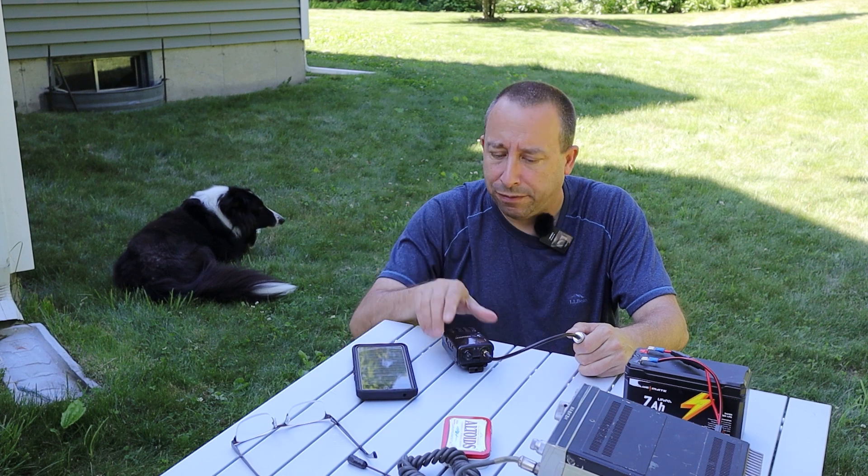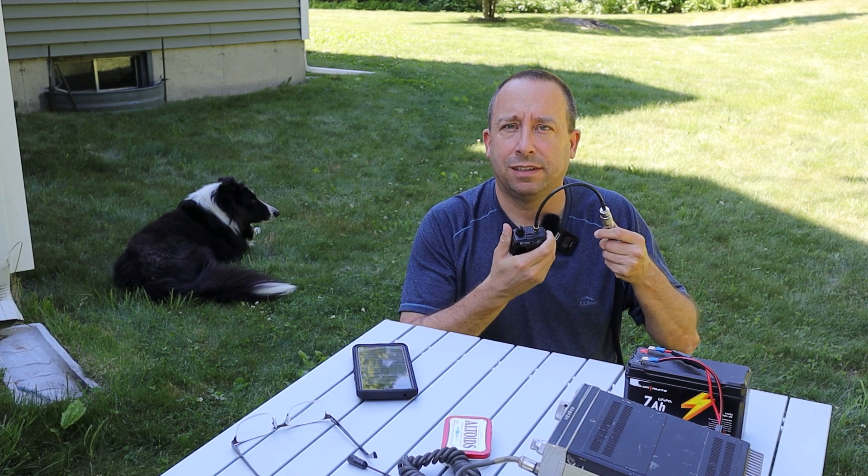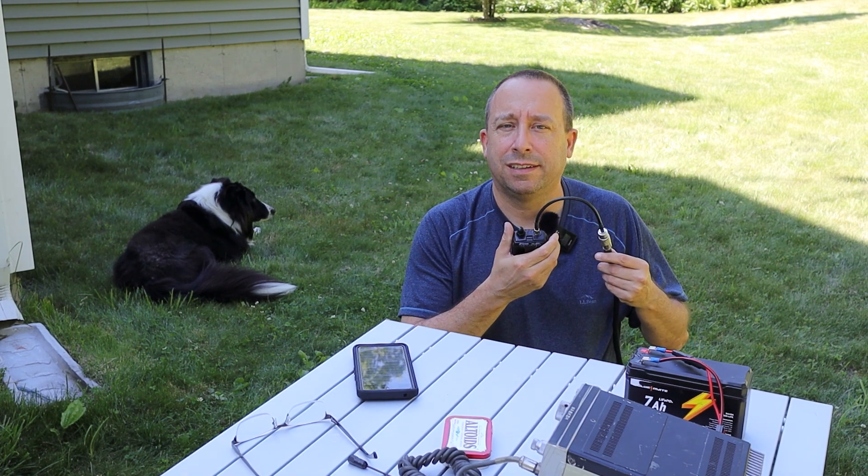My location is usually pretty bad for 70 centimeters. There are a couple of DMR repeaters within about 10 miles I can hit, but for analog repeaters I usually have trouble even on a vertical antenna in my car. There should be two repeaters in town, so let's try. I keyed up and got a response: 'Welcome to the N1TUP repeater, PL 151.4.' That was full scale. I also tried a repeater further away behind a ridge line — I was able to hit it, but the signal was coming and going due to the antenna moving in the wind on the test pole.